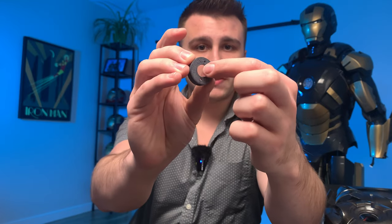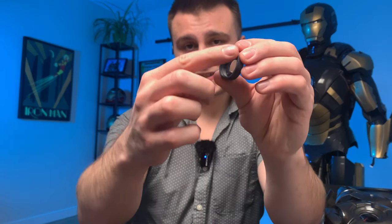So I went back into Tinkercad and designed little 3D printed mounts that hold the NeoPixel in place — a hole in the back for wiring, two tiny holes for motor screws, and an outer ring that's a press fit for an acrylic disc. I'll be releasing these files when I post this video: a version for just the NeoPixel, a version with the outer ring for acrylic, and two other versions with mounts so you can glue the base in place and screw the mount in — making it easy to swap out NeoPixels. And they're a perfect press fit for the inside of my gloves, so no glue needed.